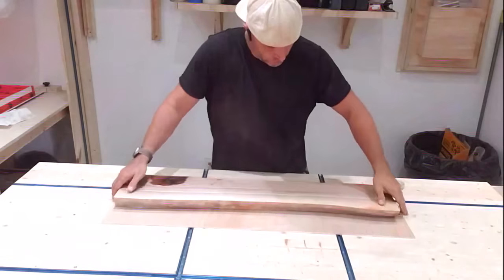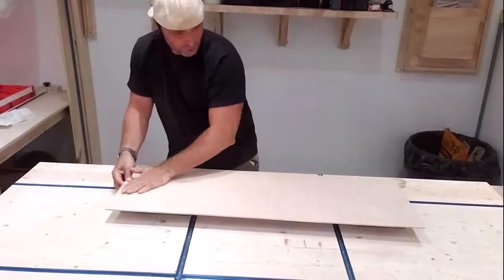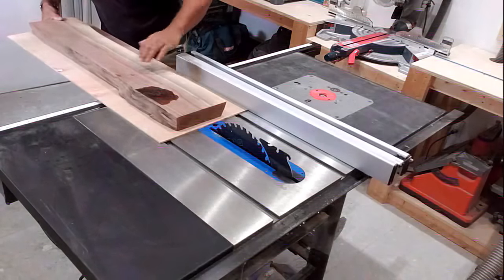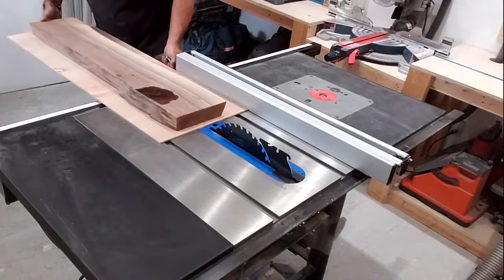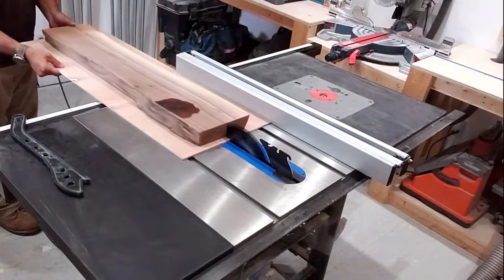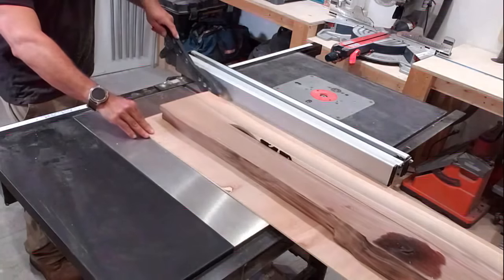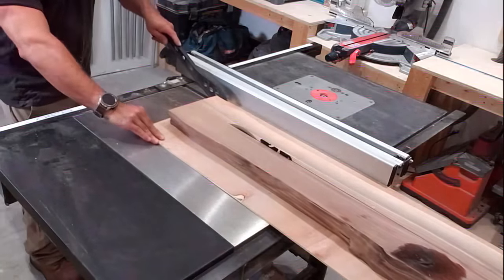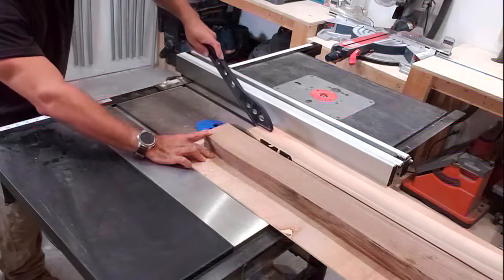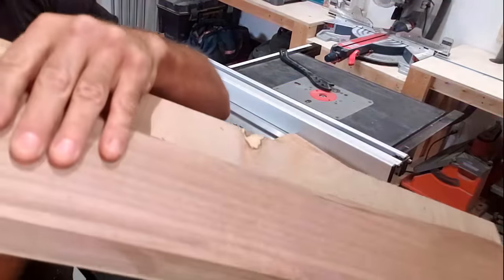All you have to do is take a very thin piece of wood — in this case an eighth-inch piece — and tape it to the bottom. You can use hot glue, which is probably a better method than what I tried. Now you have a nice clean flat edge to run down your table saw and get it really even. You don't really have to measure precisely — just get it close to the middle. Make sure you go slow; pushing too hard or fast will cause a kickback. Take your time and you'll love how it works. This piece of wood cost me maybe two or three dollars and has a bunch of uses after.